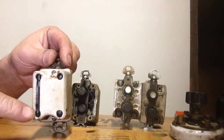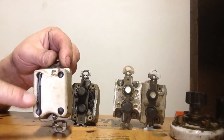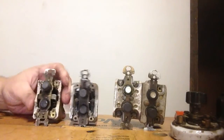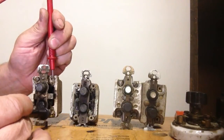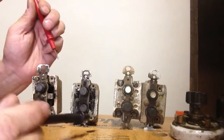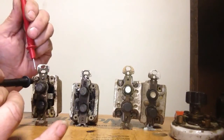Here you can see your connection is on this side and your switch is on this side, because there is a piece of brass that goes through here and carries the electricity. So this wire is where this switch is in the wall. We know this side — there's always a connection between these two. So usually one wire is hooked up here or here — that is your common wire, wherever it was hooked. This side is your switch side.